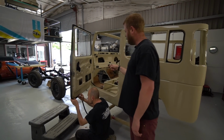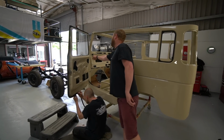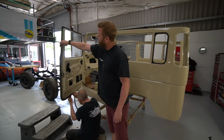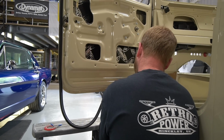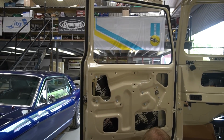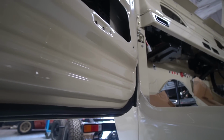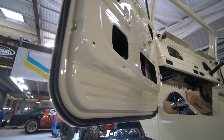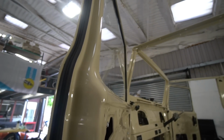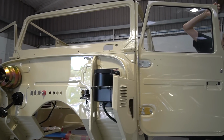All good, all the way around, until we realise that the two ends where they join at the bottom are different profiles. And we realise that at the front here, there's a transition from one continuous profile type to another, which makes sense because this side sort of hinges at the inner edge, if you like, and at the front there, it hinges at the outer edge, and I think that's because it's in that door jamb area. It's to stop it getting pulled back on itself when you close the door. Except the original one has a transition back again with a moulded corner on the front lower part of the door down there. But these seals don't have that. So I presume they just expect that you'll make do and just butt up the two ends with a different profile. And at the moment, I'm not sure what we're going to be able to do other than that. So we'll be tackling that in a bit more detail in a minute.